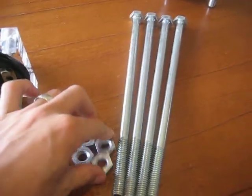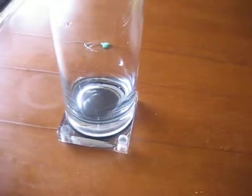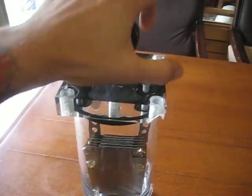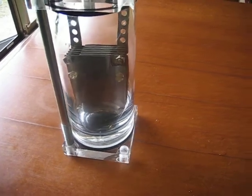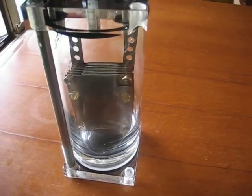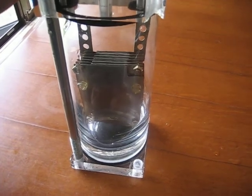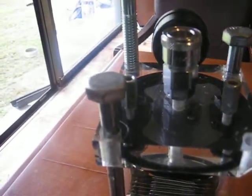I have four bolts and four nuts to assemble. I'm putting the cell into the round tube and placing all the bolts in. These are a little snug fit just because of the threading, so I'd recommend drilling the hole a little wider than the bolt itself, just to make room for the threading, or you'll have a hard time getting the bolts through the holes.